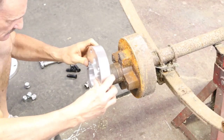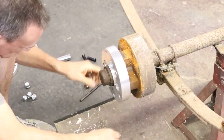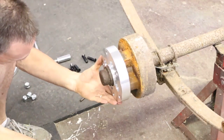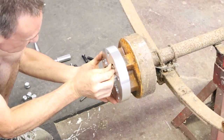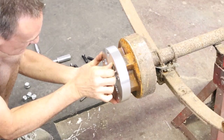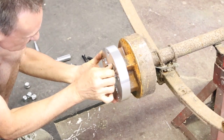Put the four lug bolt part up against the axle. In my case I have screw-in lug bolts and not lug nuts. I have four of them — they're half inch 13 thread — and so you've got to install all four of those bolts.